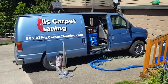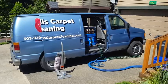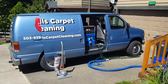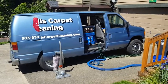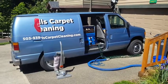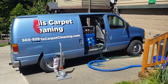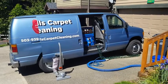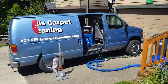What we are going to be doing today is performing what I call hybrid carpet cleaning, and as we go along I will explain exactly what that is. One of the reasons I do a pre-vacuum is because it allows me to thoroughly examine all the carpeting for spots and stains. I notice what looks like it might be silly putty or gum or something up in one of the closets, and a couple of synthetic colored areas that I'm going to pre-treat right now, just so that they have time to dwell while we work on the rest of the carpets.